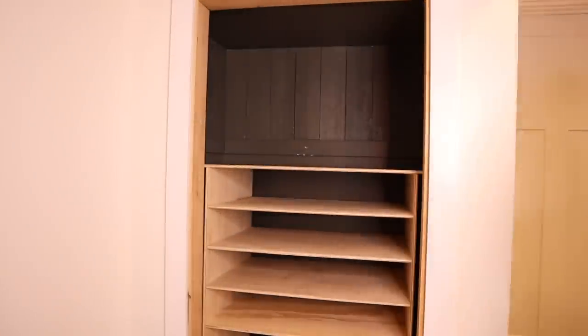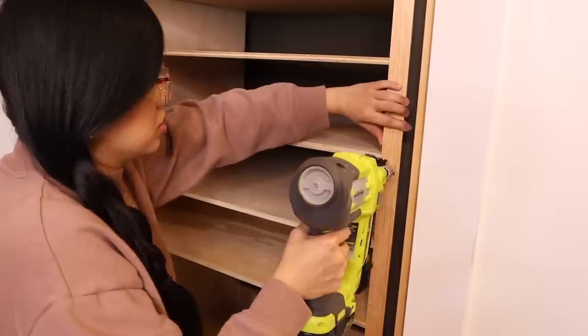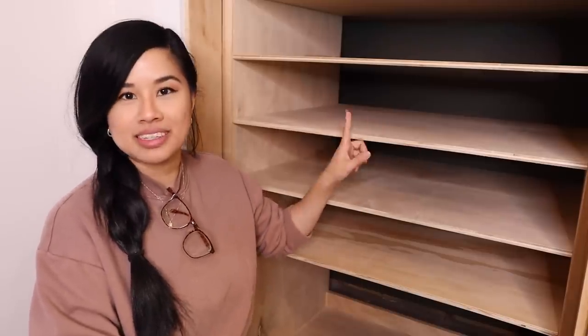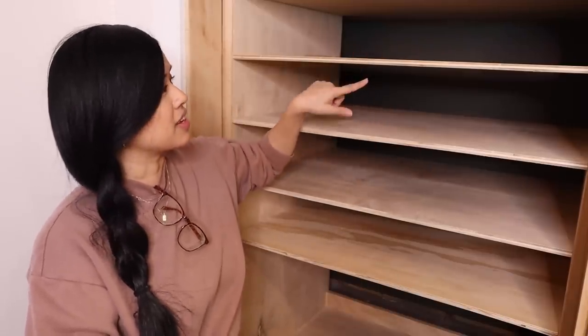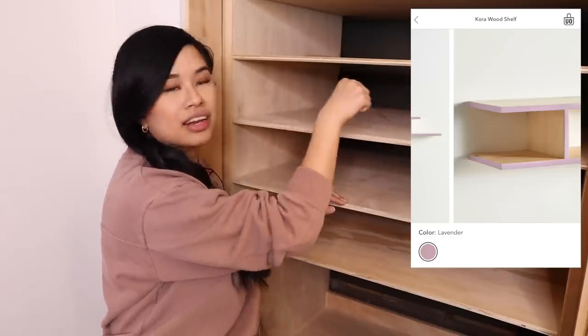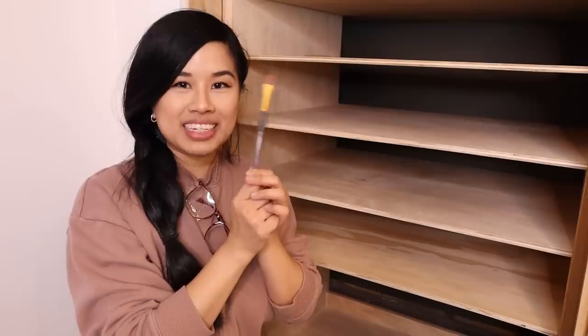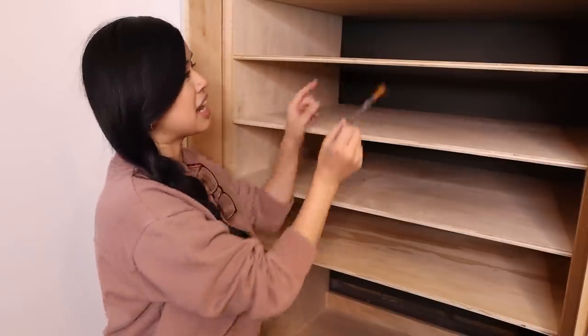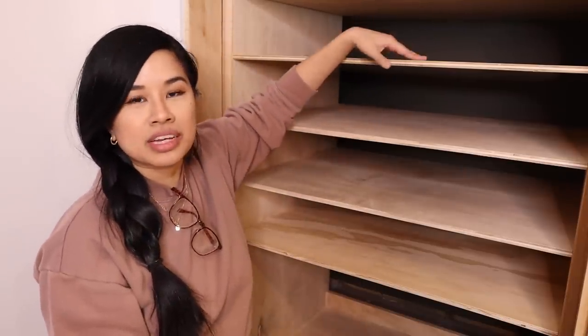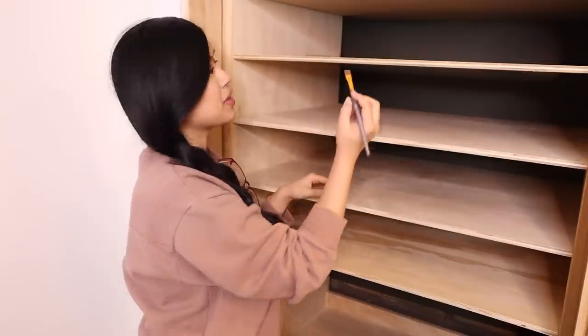You're probably wondering why I didn't edge band the edge here — because this is plywood you can see all the different layers — but I wanted to try out this trend where you basically just paint the edge and then the rest is wood, so I think it makes a really nice contrast. I have a tiny brush here and I'm just going to paint the edge with the green, and if there's any that gets over the edge you can basically just sand it off and that way you get a nice clean line. Okay, here we go.